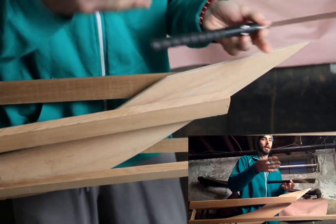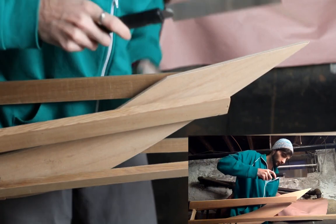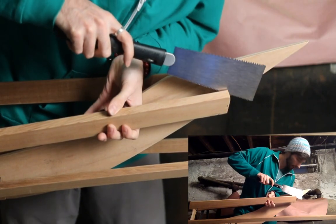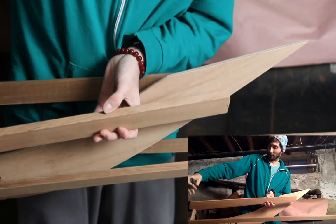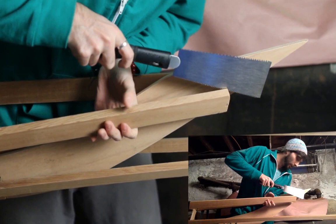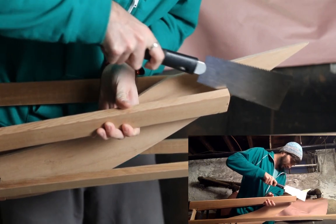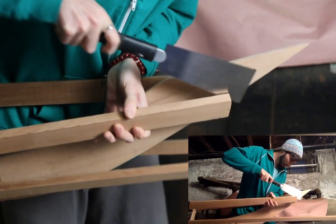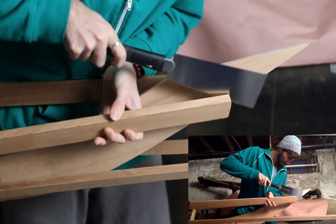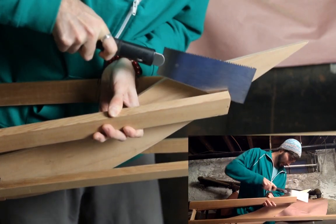So it's really hard to get the right angle so that I can show it. So I'm just going to work here. It's also kind of awkward to try to make this work. But at least the gunwale is in a really good angle attached to the frame behind so that I'm not going to have to play with it too much to sit in the right place. Let's see if I can get this cut as straight as possible. So I'm just trying to make my way straight down here. Taking a nice chunk at an angle that I'm going to sand later.